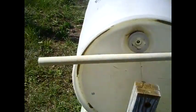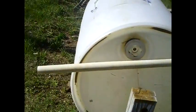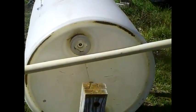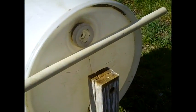The hand crank is just a piece of PVC pipe with some screws through the inside of the barrel — I put four or five screws through and used short pieces of PVC I had laying around, so I didn't have to buy anything. You can turn the tumbler without the hand crank just by hand on the top of the barrel, but the crank gives you something to grab onto if it gets heavy. You can also use the bung drain holes the barrels already have installed, but those often get worn out and are hard to turn, so I suggest the drain plug underneath the barrel.